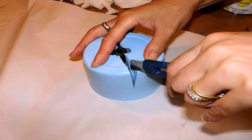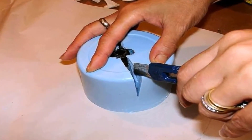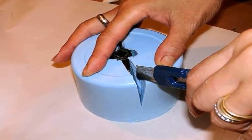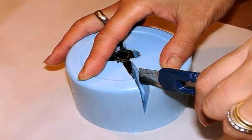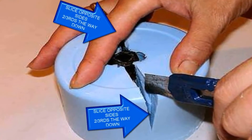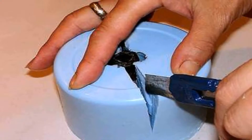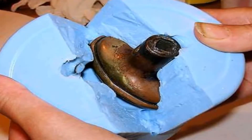When the rubber is set, we remove the finished mold from the container — we had to cut open the container to do so. Then, to extract the knob from the rubber, we turn the mold over so that the location where we hot-glued the knob to the bottom of the container is facing us. We took a sharp razor knife and carefully sliced down opposite sides of the mold about two-thirds of the way. Once both sides were cut, we spread open the mold like a clamshell and removed the knob. We inspected the mold for any loose particles, then closed it using a rubber band to keep it tightly shut.